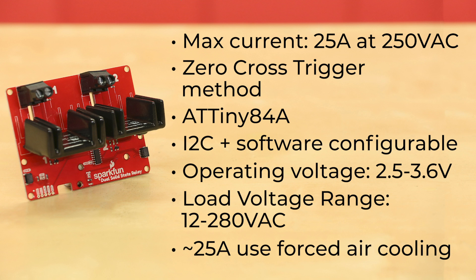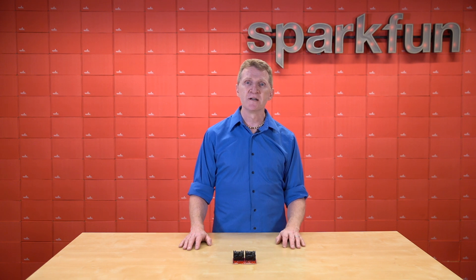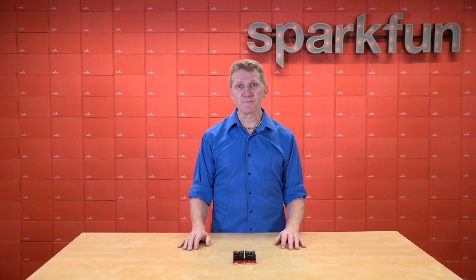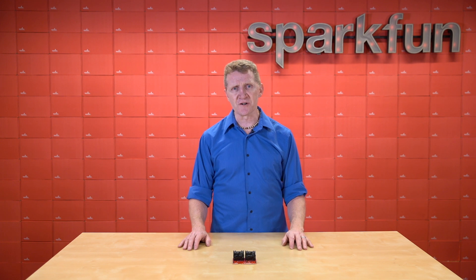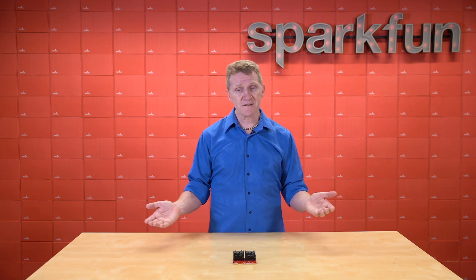You'll need to be aware too that this is a normally open circuit only, so plan your projects accordingly. Solid state relays, as the name implies, have no moving parts. And that makes them perfect in volatile environments where the spark from an electromechanical relay could be a combustion danger. And with no moving parts, but rather by using a MOSFET or an opto isolator to toggle the load on and off — no moving parts, less wear, longer lifespan.